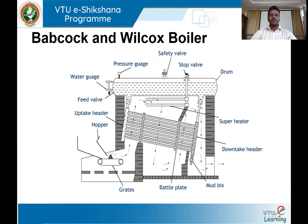As you can see in the image, the furnace is located below the boiler drum as well as below the water tubes. You can also identify baffle plates, which are placed below the boiler drum and in between the water tubes. Baffle plates guide the hot gases released from combustion of fuel to take a certain path, making them circulate around the water tubes to heat the water inside the tubes.